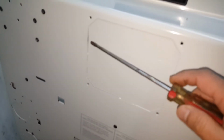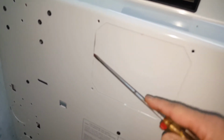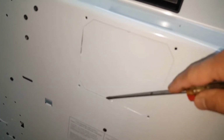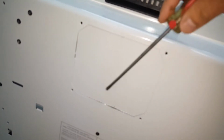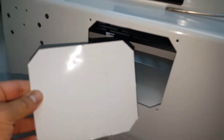in. But you have to knock this piece of metal out for the fan to fit in there. They just got it lightly tacked to the body of the heater itself. Just wedge a screwdriver in there, or just try to break them tack welds, kind of like that, and we'll see if we can get this piece out of here. So I was able to break these tack welds that are holding this plate in and completely remove it.